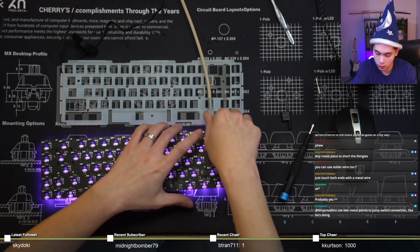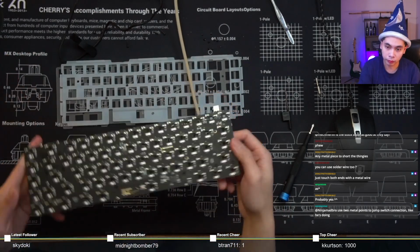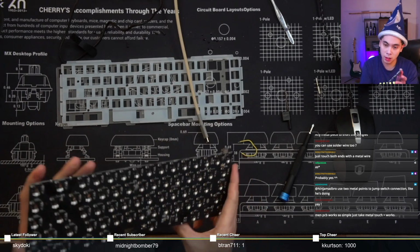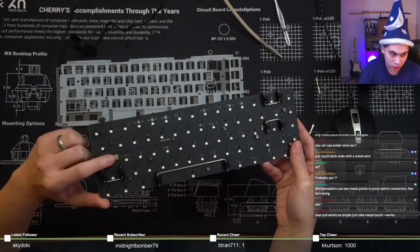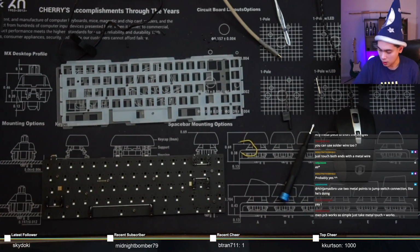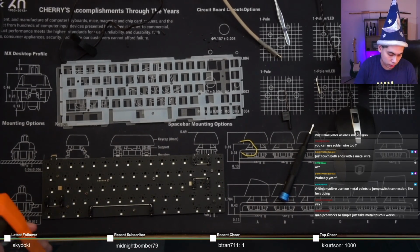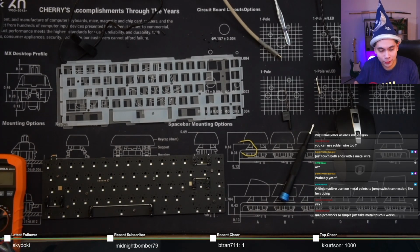Whew, okay. Couple things I wanna test out as well. Well, maybe not test out, but point out. This PCB has ESD protection. It's got that ESD protection chip right below the USB-C port, so that's good. The other thing that I want to check out is these ESD pads. These ESD pads are supposed to be connected to ground, so I will be using a multimeter just to verify that those pads are indeed connected to ground. Because if not, that would be interesting.